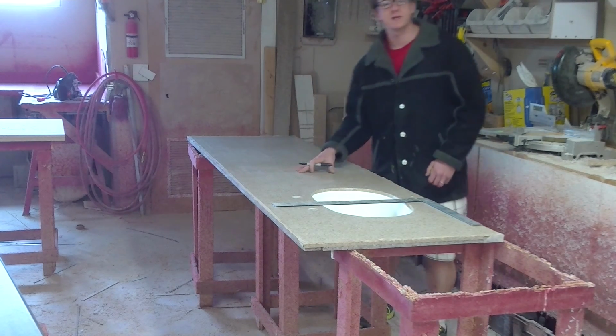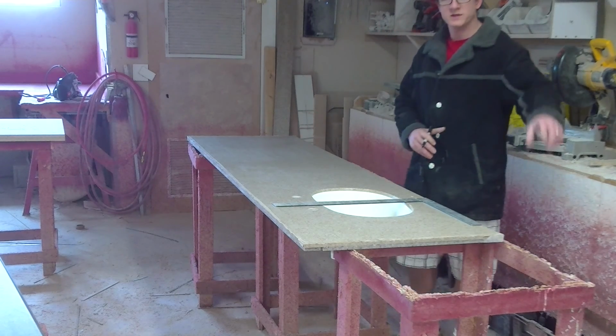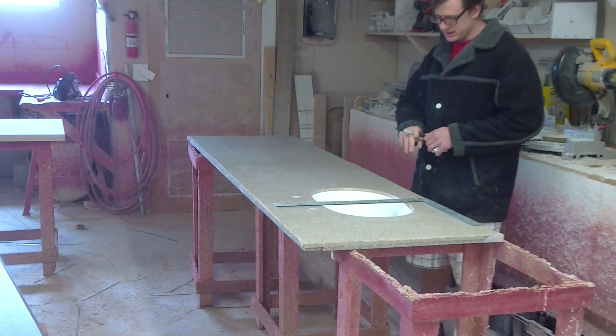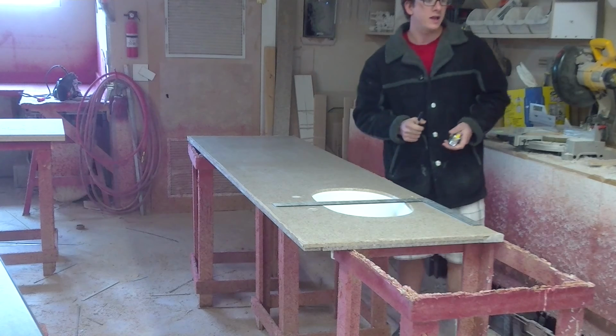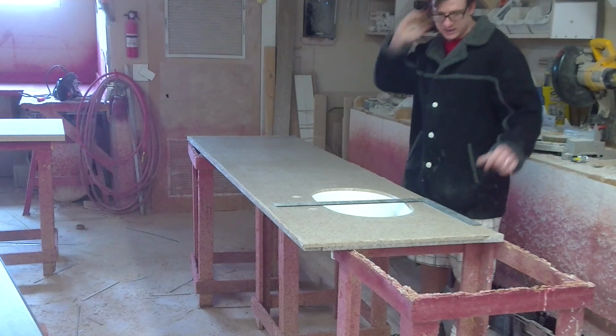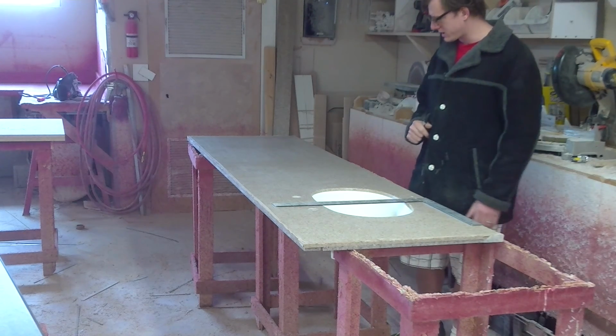After we cut it here, we're going to be losing about an 1/8 inch for the blade, and then when we shift it over, I'm going to have to clean up the seams in order to glue it together, and we'll be losing more material. All I have are a few strips, maybe 3/4 inch strips, which I can add on to each end if needed, or even onto just one end.